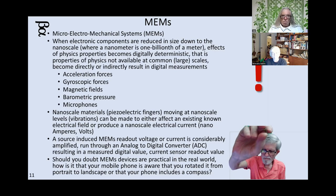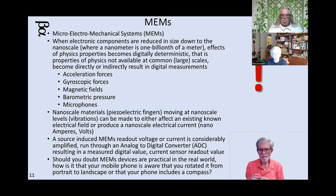This is a circuit board with a MEMS-based microphone on it — the little silver tiny chip in the middle. It's a full microphone producing a digital output, and I bought five of them in a package for about eight dollars. That's how real this technology is — a watch that turns on its display when you flip your wrist has a MEMS chip in it. Your mobile phone that knows how fast you're going and rotates the display when you turn it 90 degrees — that's MEMS chip technology. The internal technology is about the size of a grain of salt and costs about five cents.